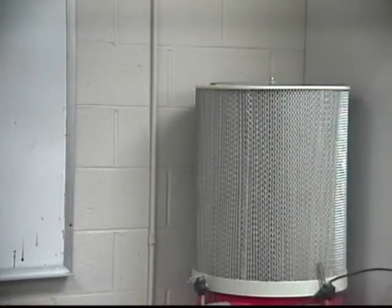Kim, is this... came back out the end after? That's another good point, because what Kelly's talking about is when you use the Danish oil and it soaks in, it looks like it's working. And then you walk away and then it slowly bubbles back out. And as it bubbles back out, it will create little droplets of thick Danish oil versus being absorbed by the wood grain. Does that make sense? And so then you have to go back and sand it and get rid of it. So the moral of the story is go back after probably 15 minutes, and if you soak it a lot, go back after about a half hour. And then just take a nice dry rag and wipe that Danish oil back off, because you don't want anything resting on the surface.